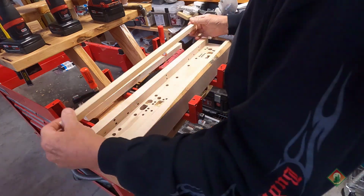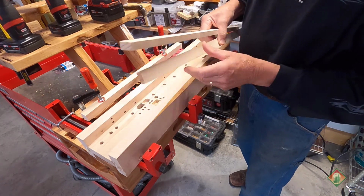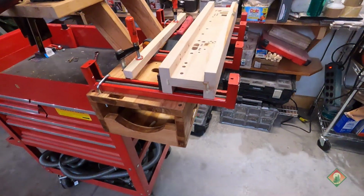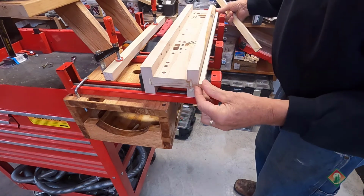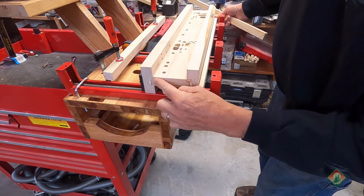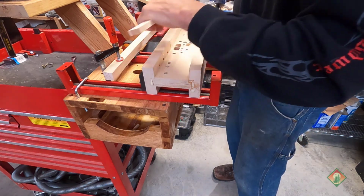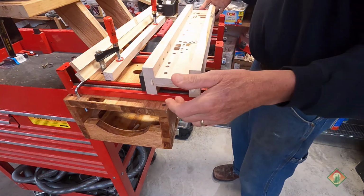So if you recall, I put a spacer in there, and that worked out really well because, on the I-beam concept, there's that center eye, the web, and I put that pressure only on there, so it killed two birds with one stone. It put pressure where I wanted it, and it also protected the edge of the beam itself. In the past, I always had to sand that off, and I don't want to have to do that anymore.